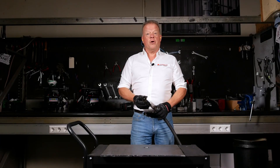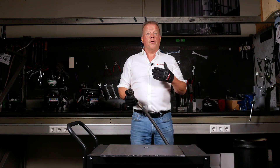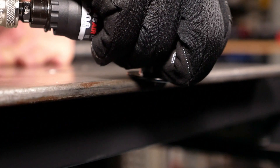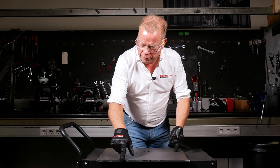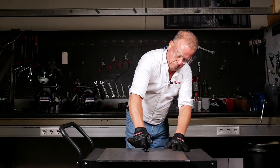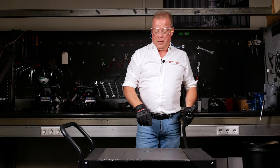Now the great thing about the BM45 Air — it comes with two sets of plates. One for beveling, what I just showed you. The other plate gives you a nice radius on your workpiece for painting and powder coating. Let me show you how it works. As you can see, from the sharpness to a very nice rounded corner so your paint and powder coat won't come off. And again you can also do it in your drilled hole. Very smooth so no trouble painting or powder coating.